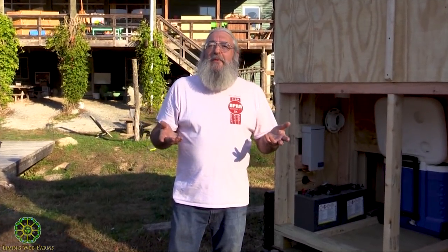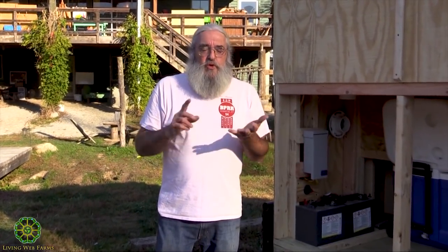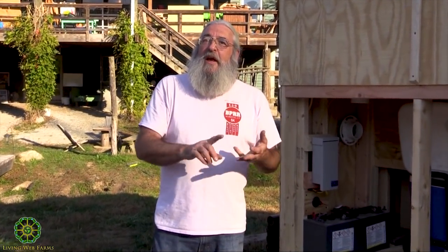I've heard different numbers, but I'll tell you right now, you cut off the oxygen with too much water, or just seal it like that, 12 hours and you are going anaerobic. It does not take long for these puppies to turn sour on you. So that's where I'm coming at with this, adding that little bit of air from the muffin fan to go into here just to make sure it cannot run out of oxygen. And so, there'll be pressure drop along the line and other issues like that, but it's like just blowing air into it. It will come into this chamber and then go up the shaft or the vent tube to the top.